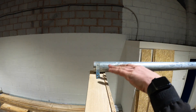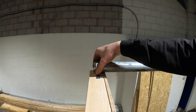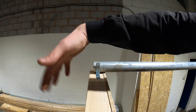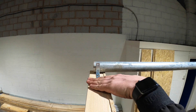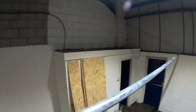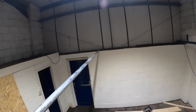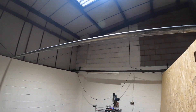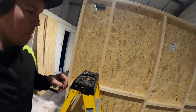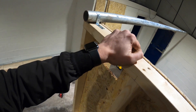Like I said at the beginning, this is going to be temporary for now - I'm going to get some proper clamps to clamp around the top. This is just to tie it in so I can do all the ledgers on this side. I need this wall to be square and right now it's not. So I'm going to get that end tied into the brickwork first. I've made the measurements so this pole is square to the room - tie that in and that will allow me to pull this wall in, square it up, and drill it through. First one's up - happy! I've just bent that bracket around a little bit and tied it in, and that's now secured the wall even with just one.